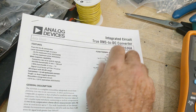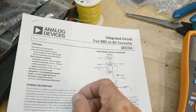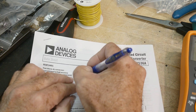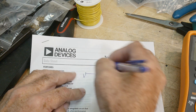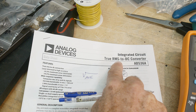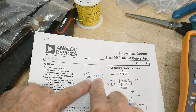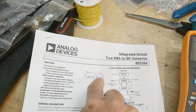What is RMS? It stands for root mean squared. So some mathematicians have gotten in the way there, let's try to make it into simpler mathematics. Root — that's square root. Mean — that's just average. And squared is squared. So if you square some volts, and take the average of those, and then take the square root of that, that is root mean squared. And it's a way of averaging.